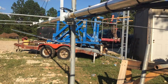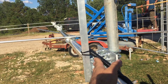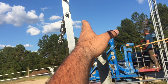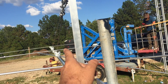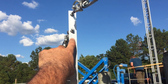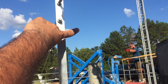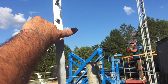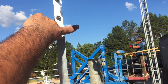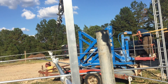The one thing I'd probably do differently if I had it to do over — they have the support on the side of the boom, so the guy wires are offset from the center. I'd probably go back and bolt on some kind of angle iron or L-bracket out here, put my U-bolts on that, so that I could go straight down the center of the boom.